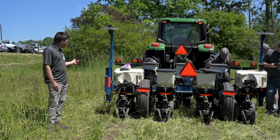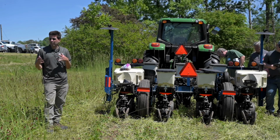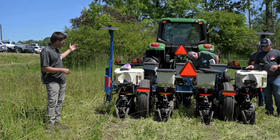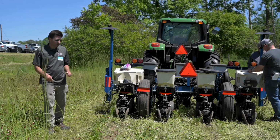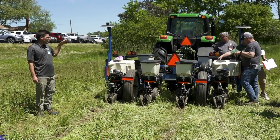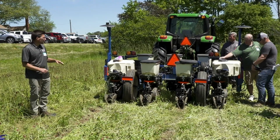But if you have a lot of long stems, they can catch it too much. So a lot of farmers will take those off and make sure there's no bolts sticking out. They'll cut down the bolts and make sure it's nice and smooth, so there's nothing catching, because you can just keep catching stems and build up a lot of stems if you're not careful. We haven't adjusted this thing at all, really, other than basic things. But yeah, we haven't really played around with this much.